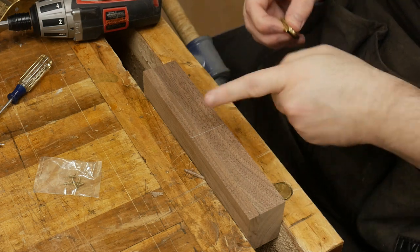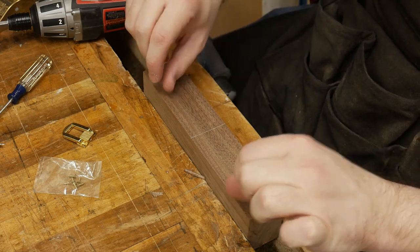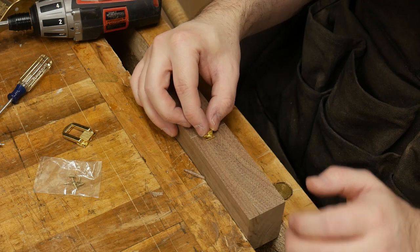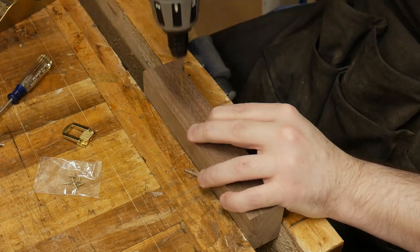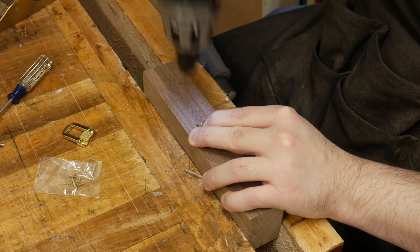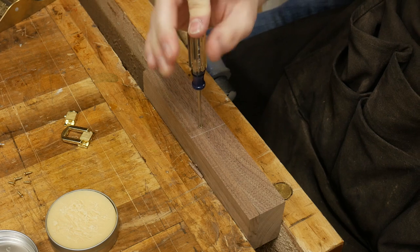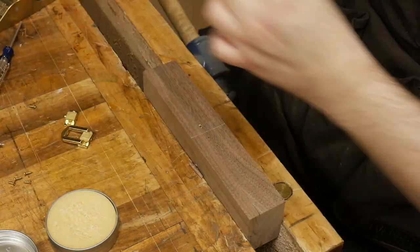To install the latch on the front, I've struck a center line here at four inches because this is eight inches long. These hinges, which I'll never use again, allow me to move the lid just a little bit, so I've got it raised up just enough to catch my fingernail on it, and I'm going to put this bottom part and butt it up against the bottom of the lid. Now that it's raised, I'm going to center it by eye on this center line and then drill with the drill bit. This is some pretty cheap hardware, but it'll fit the bill. It's all that I have in the shop.